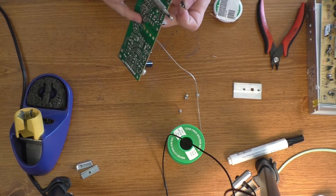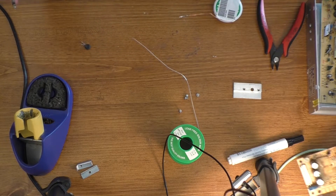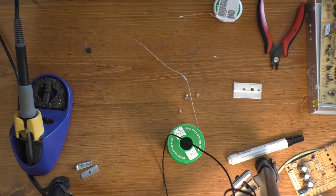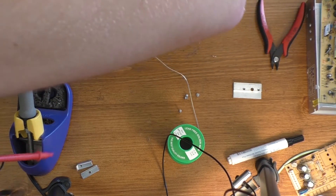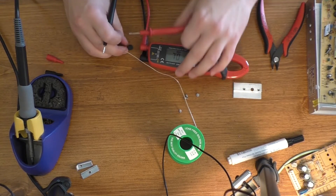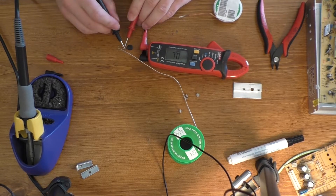It's these two pins on the donor board that are sticking up quite a ways. I'll get a bit more flux going on here. I might work better to use the desoldering iron on this too, but we'll try it with the wick — or maybe I'll just heat up both legs and rip it out because I don't care about this board at all. Getting the real thick solder out. And there we go — new component. Well, new old component. I don't even know if this is any good; maybe we should get the meter on it and actually test it. It should be roughly 50 ohms if it's good.